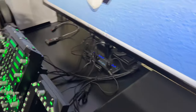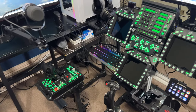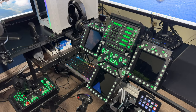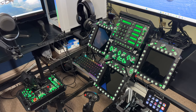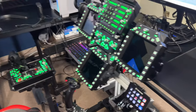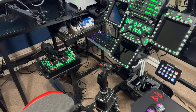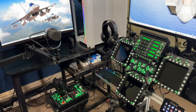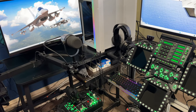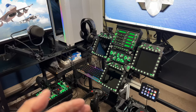I built the mount that goes on a desk. Monster Tech makes one almost identical — they put the specs online and it was a lot less money to just make my own. I measured it out at the shop, cut it all up, ordered the screws, bolts, and pieces, and put it together. It was simple. Everything's on Amazon. The place to get this extrusion — this aluminum square tubing — is a company called 8020. I don't think you're going to find a place in the U.S. that has better prices with everything available. Most of the bolts that go with it are 8mm.